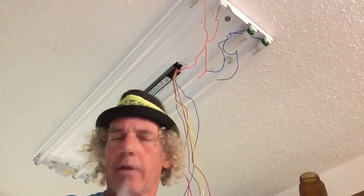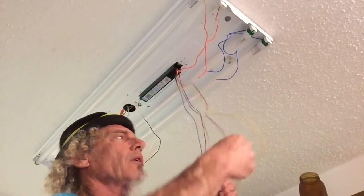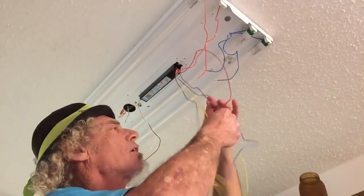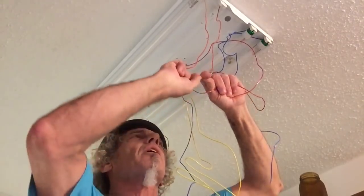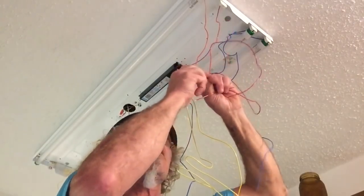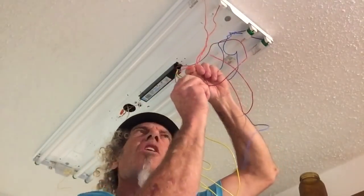I usually like to hook the power up last and hook the bulbs up first. Just follow the same color code as you took it out: red to red, blue to blue, yellow to yellow. So I've got my two red leads — I'm going to tie them on. They generally come pre-stripped, so it's not a big worry about nicking your wires. I like to get a little twist; I'll use the wire nut to do the twisting. Push that thing on there until you start seeing it churning — you'll notice it'll start twisting really well. That's a good connection. It's solid, it's not going to come undone.